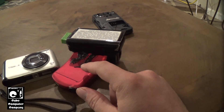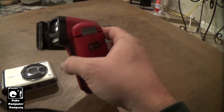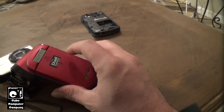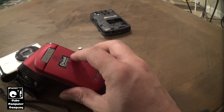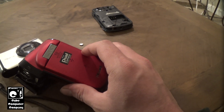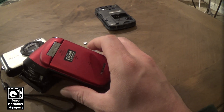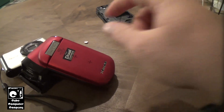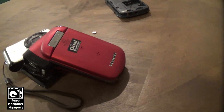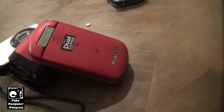I'm going to show you an example of how I fixed this one first. I should note that the timekeeping cell is, of all places, inside the viewfinder or the compartment where the LCD screen is. So changing the timekeeping cell in this camera, you can get to it easily. But it is actually soldered onto the main board — or the little accessory board in there — by two surface mount tabs that you have to be careful to remove and careful not to damage the pads on the board.